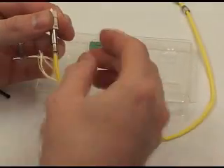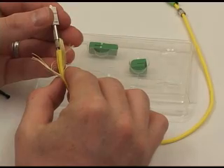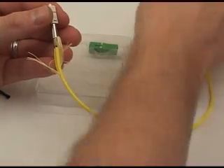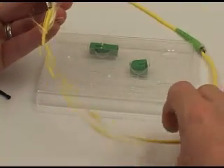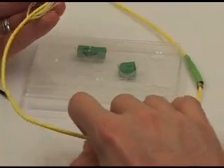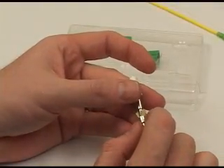Now move the Kevlar away from the 3mm cordage as shown. Then slide the crimp ring up the 3mm cordage and over the Kevlar, securing it to the main connector body. This is important because it provides the primary strain relief required to make GR 326.